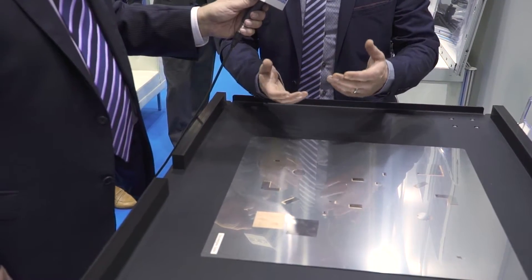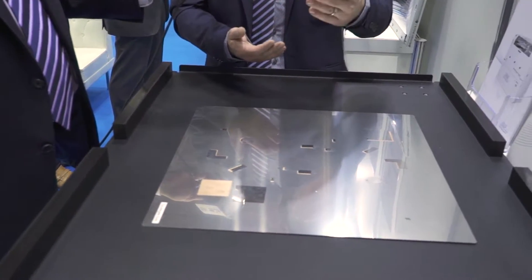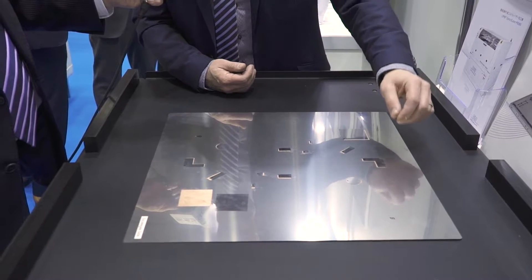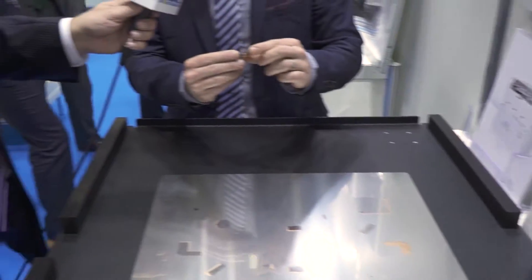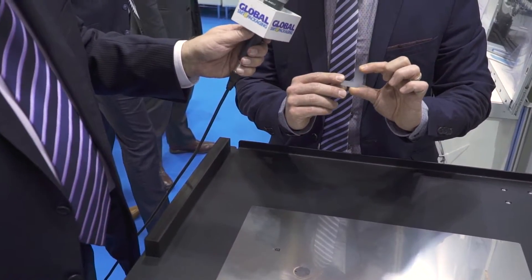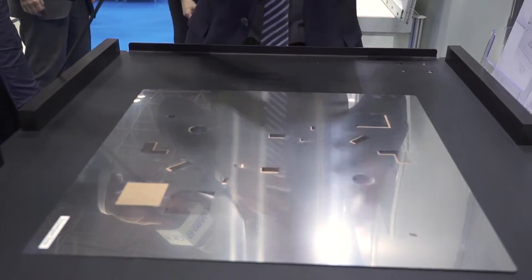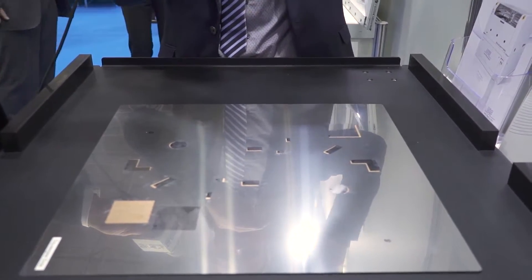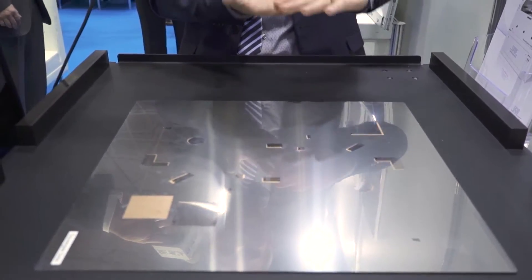Then you change the material. You go to the step material thickness — maybe you want to have a step up from 120 to 150 or even 180 micrometers. So you take 180 micrometer thick stainless steel as the next one, and you cut out the exact negative, which is the patch that is going to be welded inside the formerly cut-out area of the base stencil. Bleeding of flux or solder in strange places is avoided by ensuring a flat surface on the PCB side.